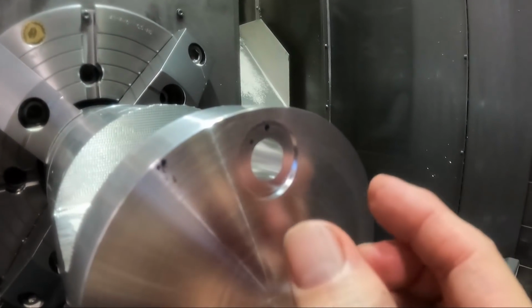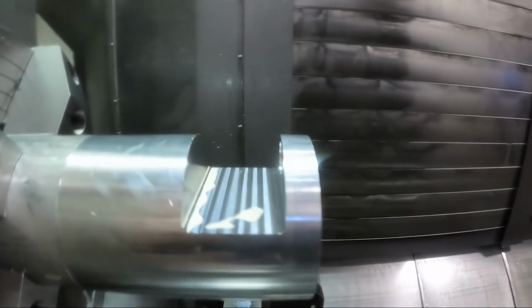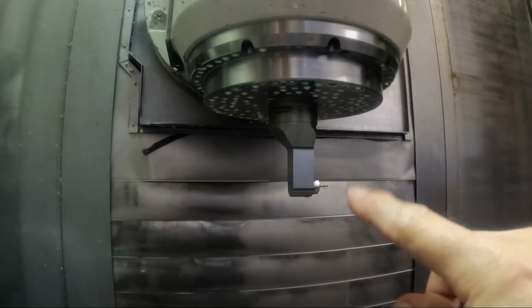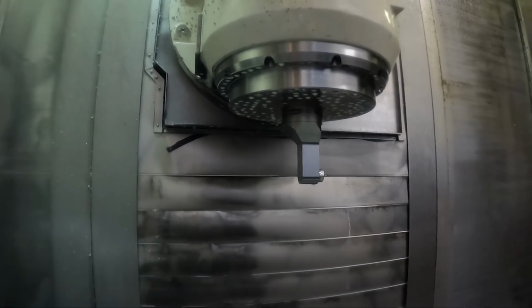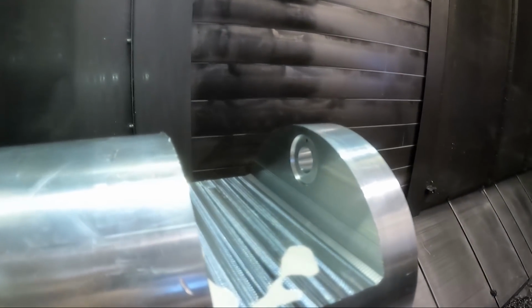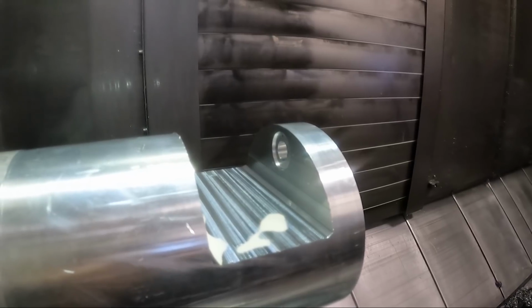The counterbore's a little bit small, but I can adjust that in the CAM software. I can't really use cutter comp on this because I've defined the tools as lathe tools, turning tools, if you will, because that way I can clamp the spindle in the different orientations. But the problem is that there's nothing in the tool definition to describe a diameter or radius. There's a tip radius, but I tried that and used cutter comp, and it didn't even pick it up.